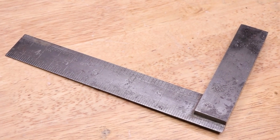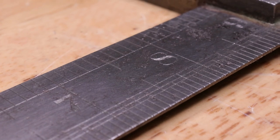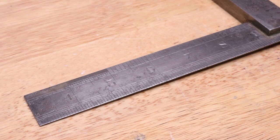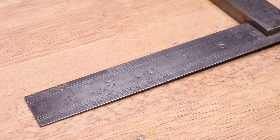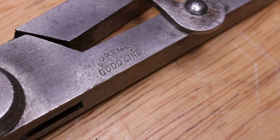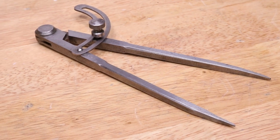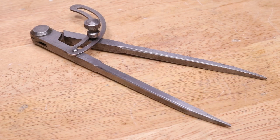Well, to wrap things up, I hope you enjoyed the video today. I'm very happy with the results — there was certainly a great tool underneath the layer of rust. This video certainly is different to many other restorations here on YouTube, but it really does capture the vintage look that I was going for. Here in the workshop I have many other vintage tools of his that all have the same basic look, and they all have a little bit of black oxide, maybe a little bit of tarnish after a hundred years. The last thing I would want is to have tools of his that look different — I wanted them all to have the same overall look and I think I have been able to capture that. A thin film of oil will ensure a long service life and protect it from rust. Thanks for watching.